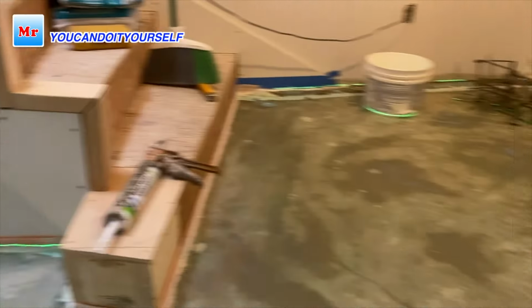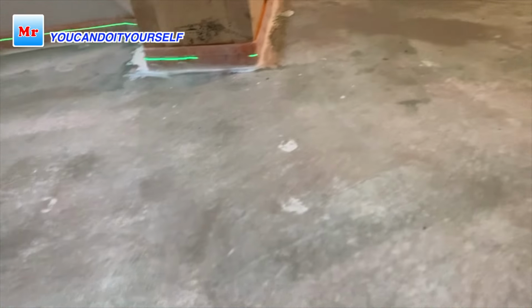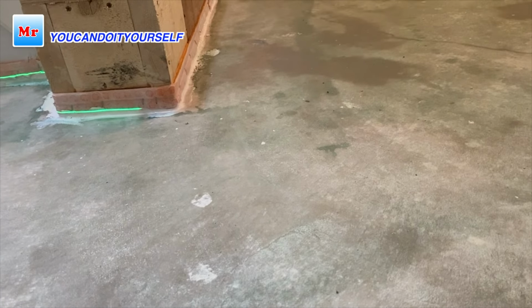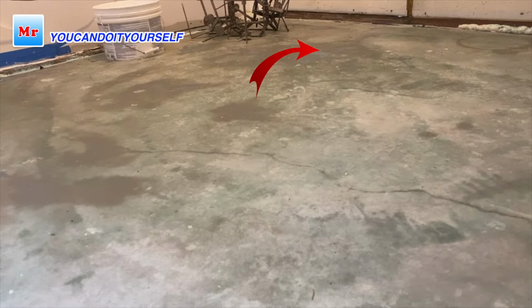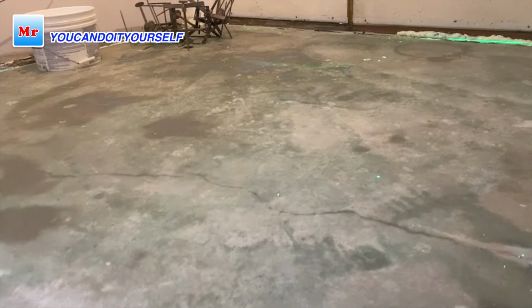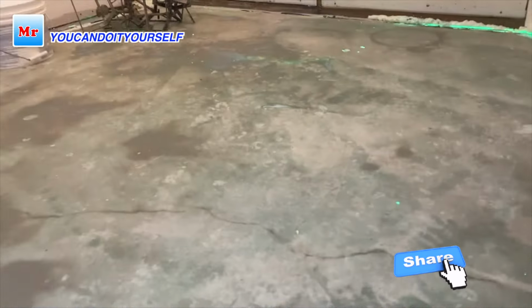Here you can see, if you have a green reflection on the subfloor, it means this is the highest spot. So what can I see here? I slide the laser down and up. You see in front of the entrance we have the green spot. It means this is the highest spot. Also on this right side is a high spot, because we have reflection. Here is a high spot. So we have to move the laser a little bit up until this high spot is not visible with the green shadow.